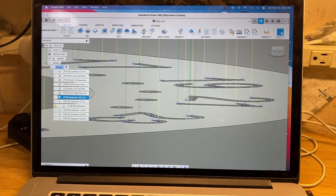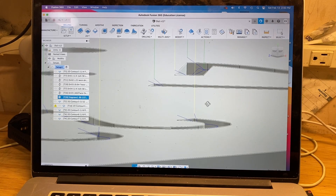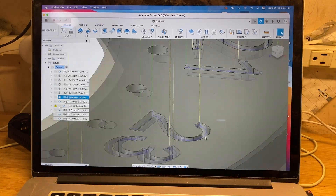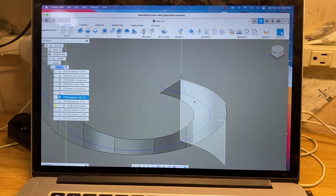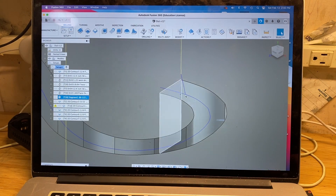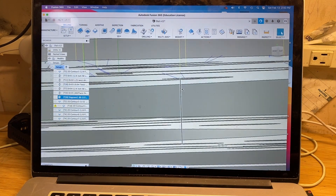What that does is you can come over here and look inside the model and see what the tool path looks like. What you want to make sure on a good engrave command is that you have one line going down the middle — that'll give you a clean look. It'll come down and give you both edges, but this way it'll be a little more narrow than the original because it thinks it's got a wide cutter and it's higher than the actual material — you can see it starting above.